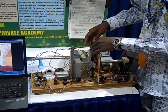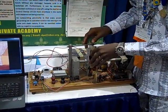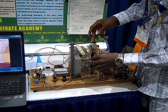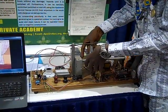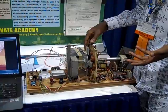The magnet sees magnetization for a short period of time, which creates a kicking-like effect on the magnet, causing it to rotate in one direction only. When we disconnect the batteries from the terminals, it causes a collapse in the magnetic field around these copper coils, and this induces back EMF.